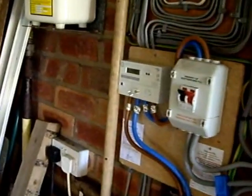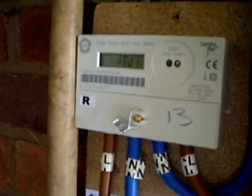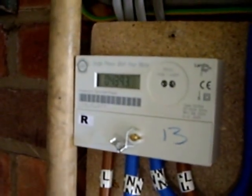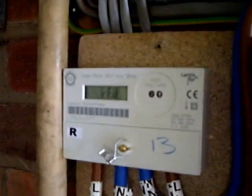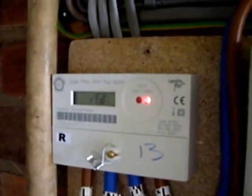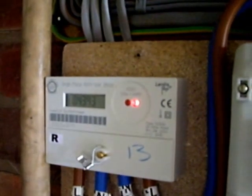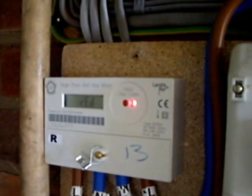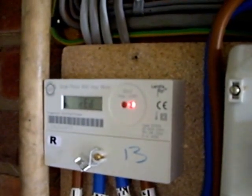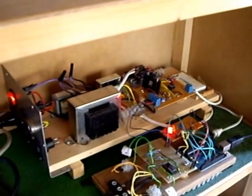If I go back to just taking 750 watts, the flashing LED goes off. We're back to 1 on the power scale, and hopefully we'll still be exporting. This doesn't directly show that we're exporting, but the absence of flashes means that we're not importing. It does take quite a while for exporting to show. If I turn the power off and back on again — there it is — showing that we're still exporting and we're down just at level 1 as we were before.